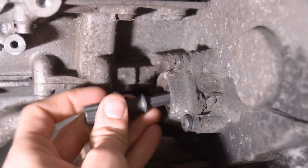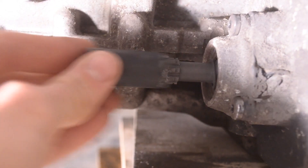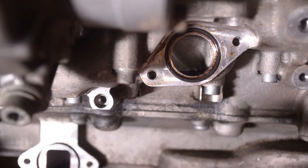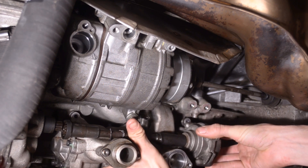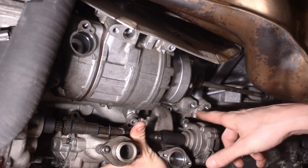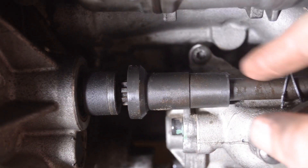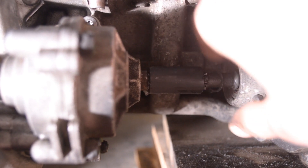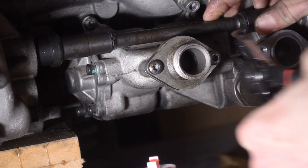Let's put the new shaft in. I also put a snap ring on there, so just lubricate it and then we can put this coupler on — then just leave it just like that. Put new O-rings on the ports and hold both of these in with assembly lubricant. Then put the pump on, make sure it slides onto the dowels nice and easy, and you don't lose those O-rings. Tighten all the fasteners on the top and the bottom to 10 newton meters. Now slide the spline drive over the shaft for the water pump and the oil pump, and attach the three snap rings.